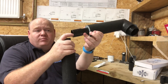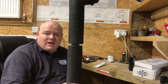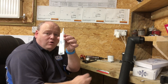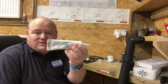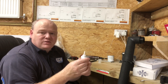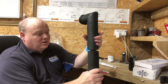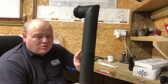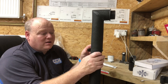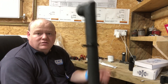Once you've got your pipe in and the lagging over the top, glue the socket, put some glue in there and push that together. Get your bond and seal, open it up, cut your nozzle - it does go a bit stiff so you need to warm it up a little bit. Put that around there, squeeze it together, and a little bit will come out. I just go around that with my finger personally, then put the clip over the joint so you don't even see the joint.